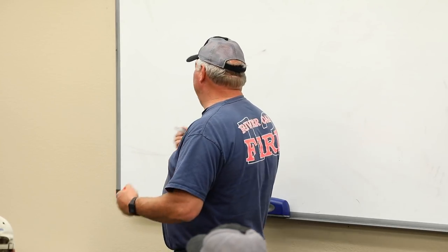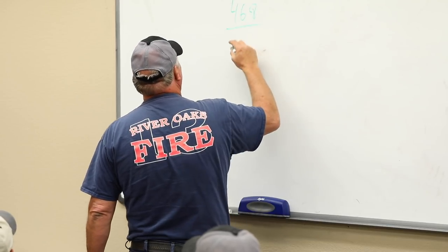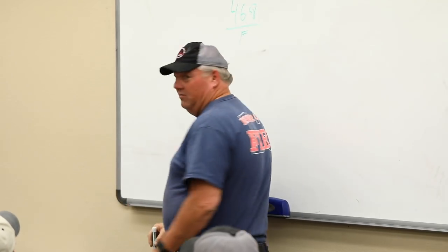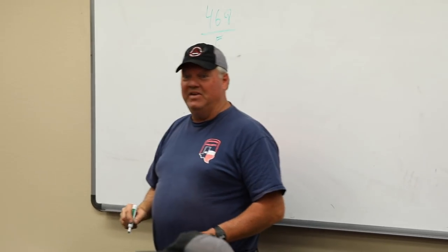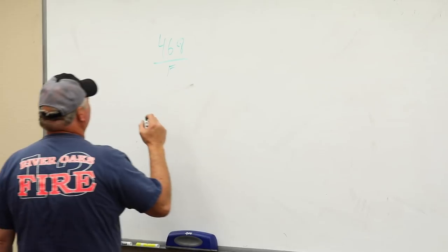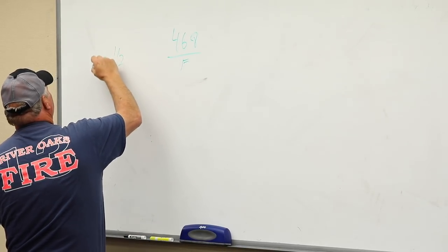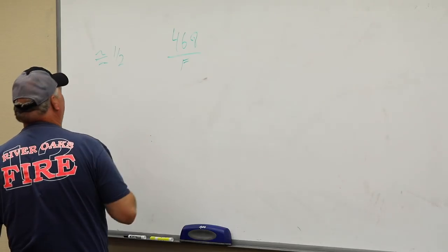468. 468 divided by the what? Megahertz. Frequency in megahertz. So do you already know where they came up with the 468? Something to do with the speed of light. Is that what it is? No. This is a half wavelength, or approximately half wavelength formula.